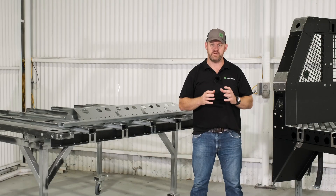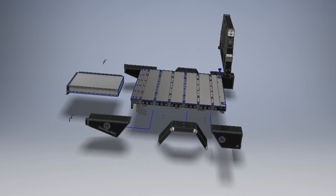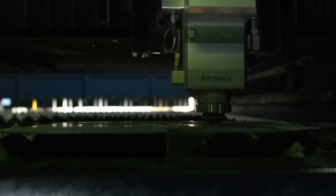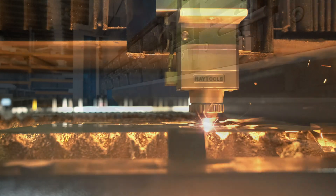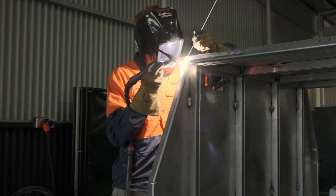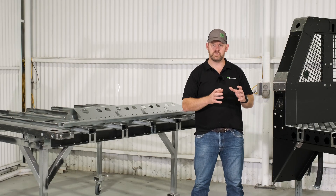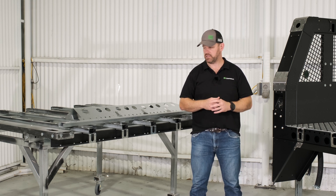Here at Chameleon AMLS, all our products are designed by our team of engineers in-house in 3D CAD software. We then take those models, export them out into an NC file format ready for the robotic machines that we use to laser cut and fold, before they come back for fabrication, manufacturing, out for surface treatment, and in for final fit-up and assembly. All our bases, lockers, and flexors are all designed and manufactured in that same process.